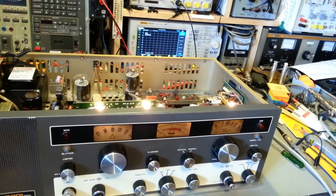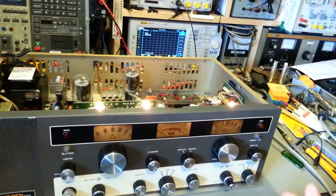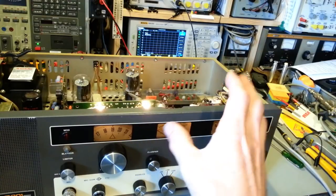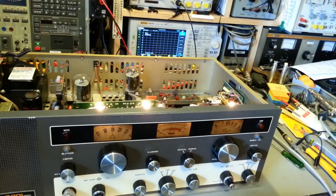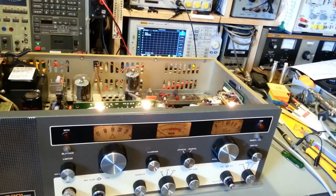When you're adjusting old tube radios, you adjust the TVI filter; in modern-day radios, it's called a 54 megahertz trap circuit. That's what you use the spectrum analyzer for, adjusting for minimum power at the second harmonic. But, yep, good sign. Transmit's actually working just fine in AM and lower sideband. Upper sideband, not so much.